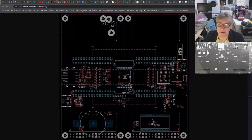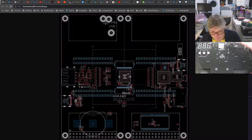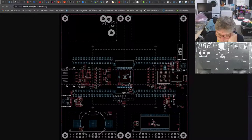So we could have an LED on the CS pin. Or actually, we could have an LED on the serial out from the ICE 40. We could have more than one LED. Given that we've got a spare part of the RGB LED, I could just connect that to the serial out on the ICE 40. It's not really used, actually. Problem solved. Yes, we can do that.